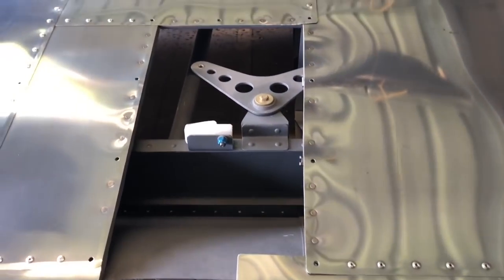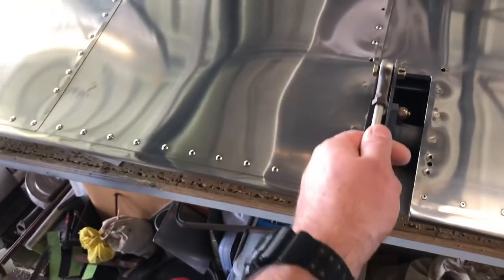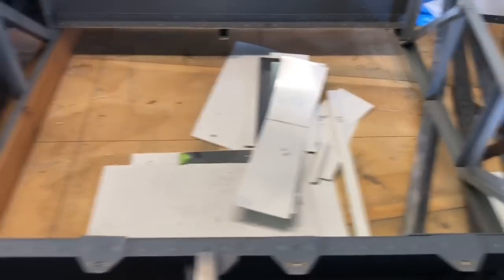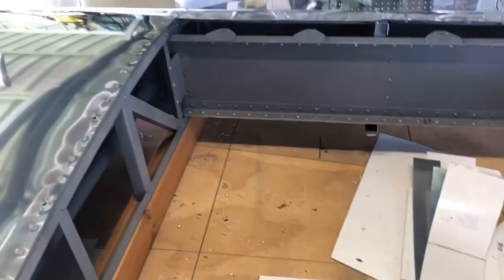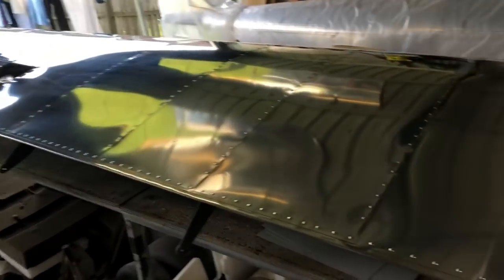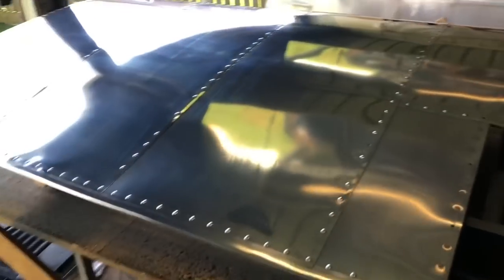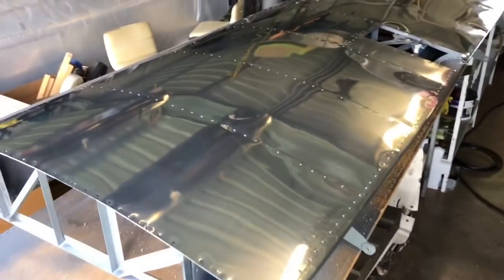There's a panel I've got to make for the aileron pushrod. The other trailing edge has a flap mechanism there, so that's going to sit up there and another little fairing needs to be made. That's a torque shaft with a flap. This big hole here is where the fuel tank is going to go, and there are the mounts for the tank when I get around to that. So now I've just got to flip it over and do the bottom skins with all the inspection panels. Once that wing's done, I'll do the next one - which is up there, ready to go. So shiny. Love it.